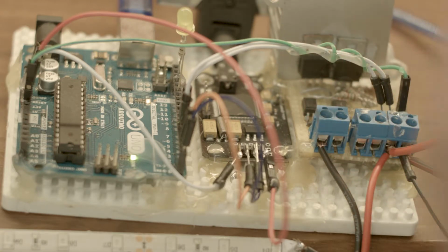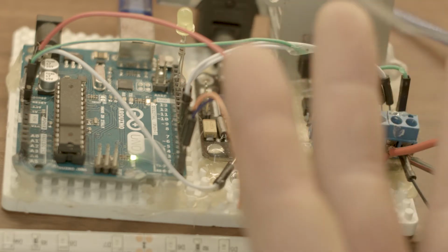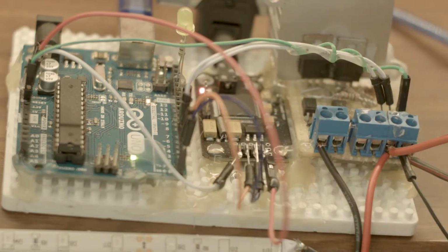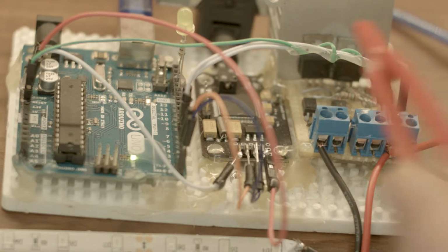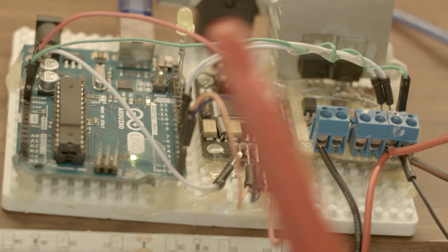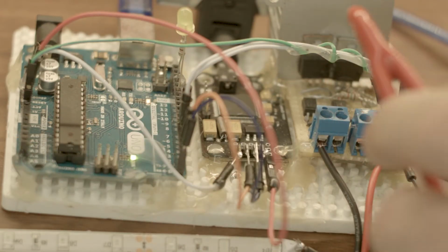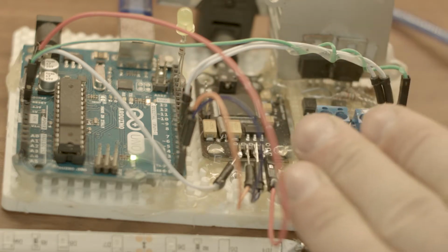Also, Mr. geeetech voice recognition module here is advertised as having memory for 15 voice commands, which is true, but the memory is spread throughout 3 memory banks, and on each memory bank you can get 5 voice commands. Okay, very simple. Now, what's the problem? You will need to switch memory banks if you want to use all of your 15 voice commands, and it is a bit sluggish, slowish. Yeah, changing memory banks doesn't really work. Okay, so I use only one memory bank, 5 voice commands, and this works awesome.